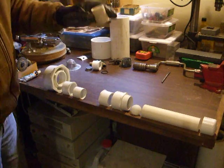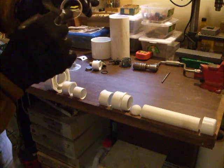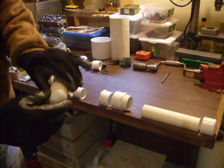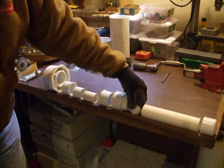This is an inch and a quarter piece of pipe with a bevel on it on the inside — doesn't have to be a lot, just enough for the ping pong ball to seat in it. That's what's going to seal it. That's why we cut a bevel in there. You don't have to do that, but it's going to make a little bit better seal if you do.